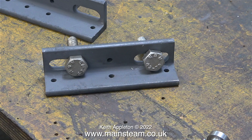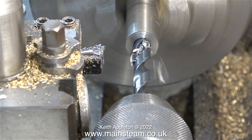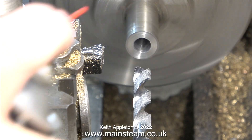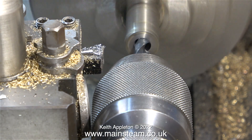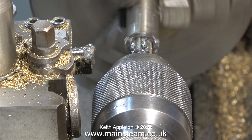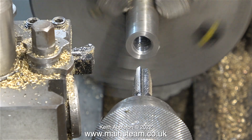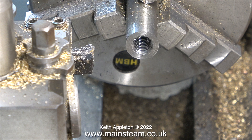I have quite a few stainless steel bolts — they are M10 size and I think they're ideal for the job. All I need to do is make some fittings for the bolts, chop the bolts to length, turn the end and thread them to take M6 Allen cap head bolts. I need to make four outer sleeves and thread them in the middle M10. That will allow the M10 bolts to screw into these fittings, and once the M10 bolts are shortened I can drill and thread them M6. Here you can see me cleaning the tap with a paintbrush after the threading operation — now I have a really nice M10 thread in the hole in the centre of the bar.